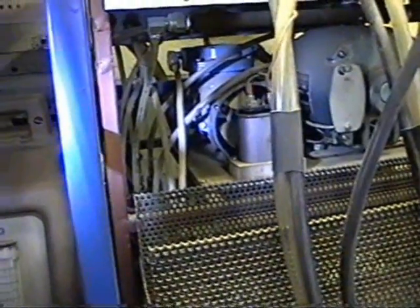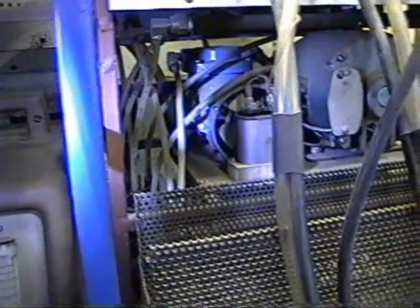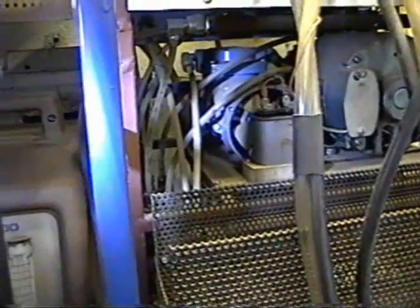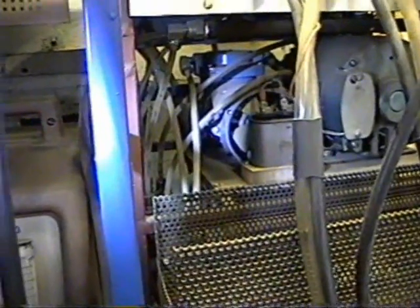If you don't have gas to your shop you can use propane barbecue tanks. These are about forty dollars at the hardware store and cost about twenty dollars to refill. One refill will last for literally a month of heavy glass blowing. It's an awful lot of gas.